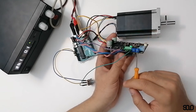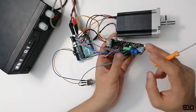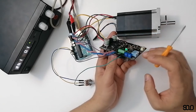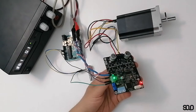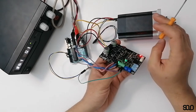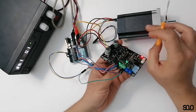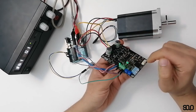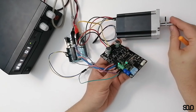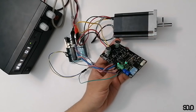Both KP and KI together provide smooth control. In this tutorial, we're going to see how to tune them for an unknown brushless DC motor. You don't need to tune any parameters from outside. We don't know the motor parameters, the load on the shaft, or anything about this motor — and we want SOLO to sensorlessly control the speed of this brushless DC motor.